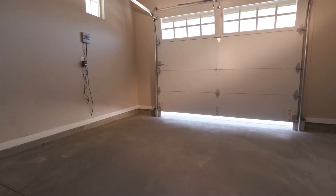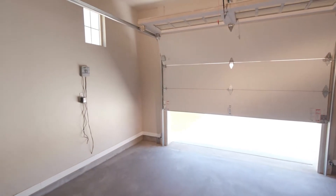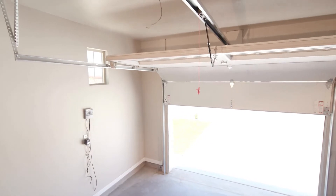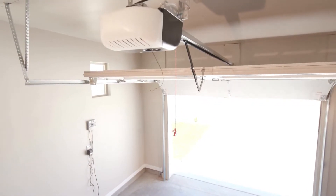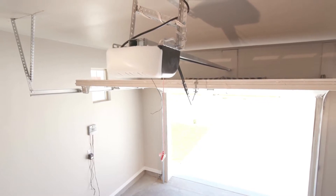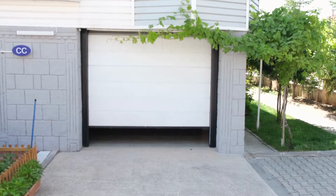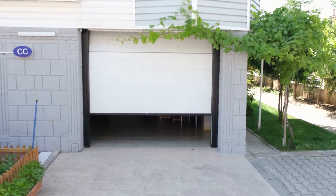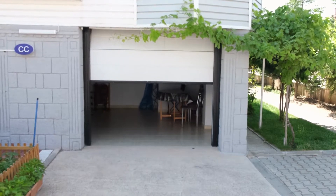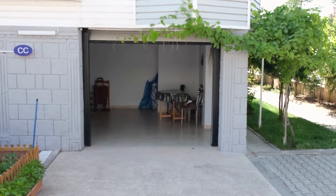Garage Door Sensors. It's imperative to monitor the garage door continually as this is a vulnerable space inside a home or business. A garage door sensor or contact will notify you if your garage door is open. It comprises a specialized magnetic switch and magnet installed on a garage door, constructed to be tough enough to handle harsh environments compared to a regular door sensor. When the garage door is raised, the movement breaks the circuit and activates the alarm.